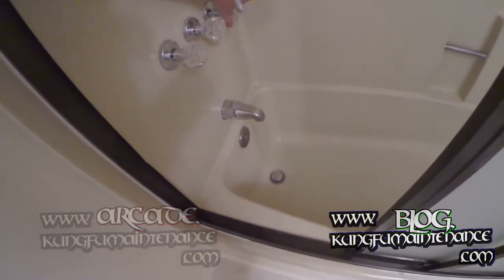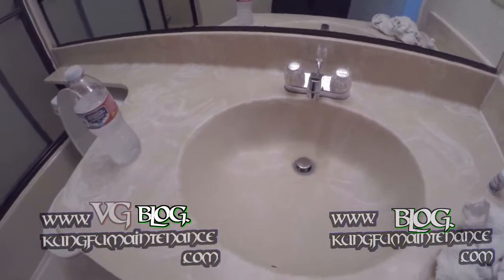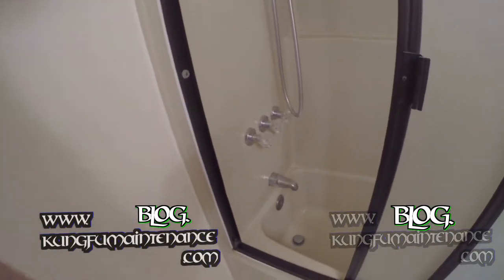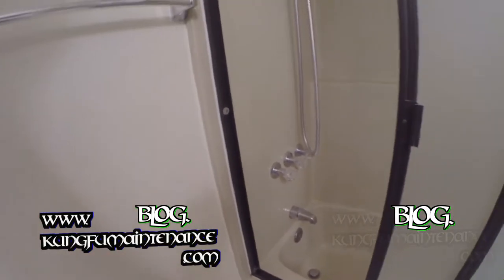The cold side looks just fine. Hot side water pressure is good everywhere else, and I just had a major plumbing leak the other day. So it's possible some soil or stuff got into the line and traveled down and got caught in the cartridge. So I'm going to change that out.